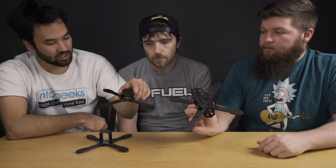We don't really race it because it does have a lot bigger profile to the air. And also, for me at least, with this, if it's a long track, I can grab an 1800 strapped to the bottom. It doesn't affect anything, right? Or I can still balance it and everything. This prop or that prop, or 6-inch props, because we fly the bigger ones. We have this variable, and when you're racing at different tracks, every single track is different, and we can swap out the battery, we can swap out the props. It's super easy to have all that working.